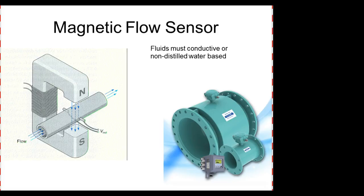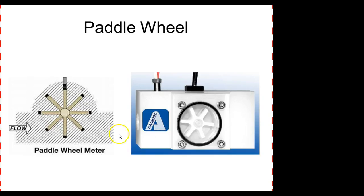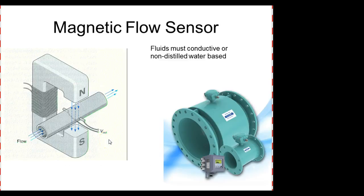An example we would use would be probably this thing over here, this galvanometer on it. We're going to add some resistance to the flow. And if you add resistance to the flow, then you're going to get a pressure difference. Now your sensor's creating a pressure difference, right? Y'all understand that? This guy right here doesn't do that. It picks up the flow rate using the induction principle, being induced by the rate that we move past.